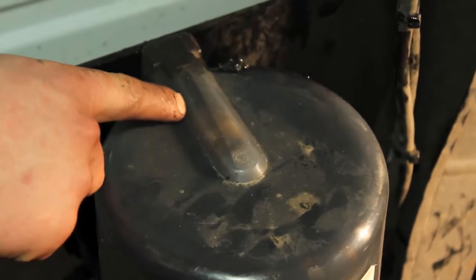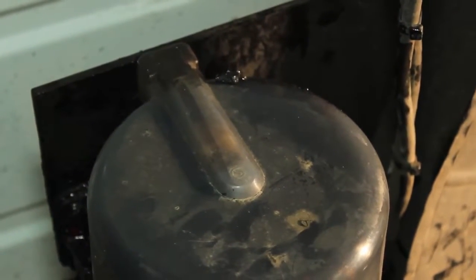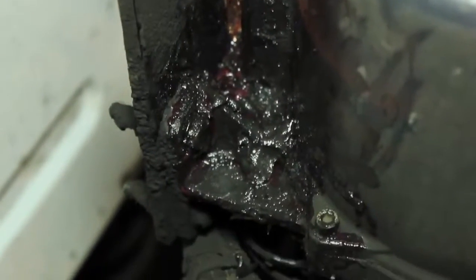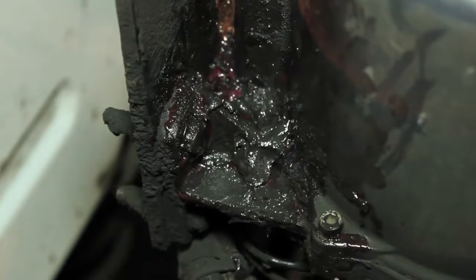In order for the pump to work properly, air is vented through the molded vent tube located on the back of the reservoir. An overfilled reservoir can cause the vent tube to become blocked with grease, which would prevent the pump from working properly and will take much longer to refill the reservoir. You must completely remove and clean the reservoir and vent tube if this occurs.